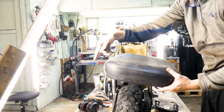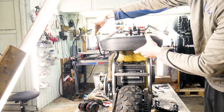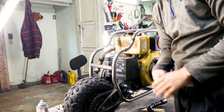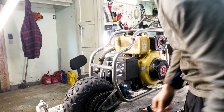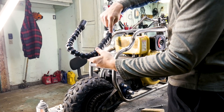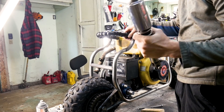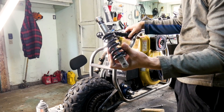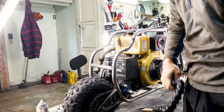I appreciate everyone pitching in on seat ideas. The only tractor seat I could find online was 15 inches across — same as this seat from workout equipment — and the fact that it goes out from the frame looks really goofy, so a tractor seat won't work. The second most common opinion was a seat with suspension going straight down. I have some shocks and a bicycle shock. The plan is steel tubing bent 180 degrees with the bicycle shock underneath so we have at least a little suspension. The motorcycle shocks are meant for a full rider and motorcycle, so they'd be too stiff.